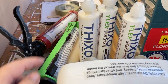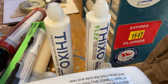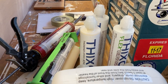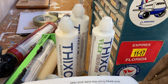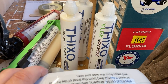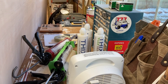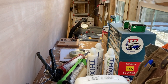It's about 40 degrees outside — around 50 in the shop. We kept the tubes inside overnight and now we've brought them out. We have a little portable heater to keep the shop warm and prevent the tubes from cooling off too fast, because when the resin gets cold it starts thickening up and becomes more difficult to get out of the gun.